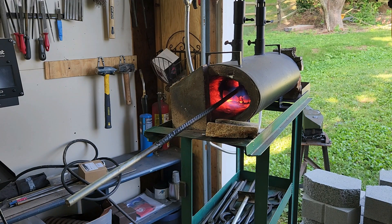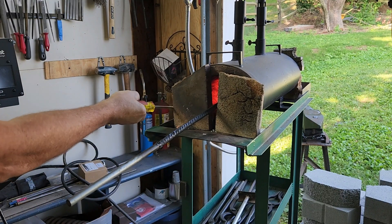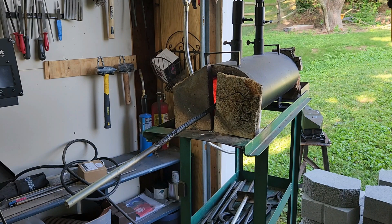I can compact it as tightly as I can into the canister. We want to bring this up to about 2,250 to 2,300 degrees Fahrenheit and hold it at that temperature for about 20 to 25 minutes. They call that a heat soak.